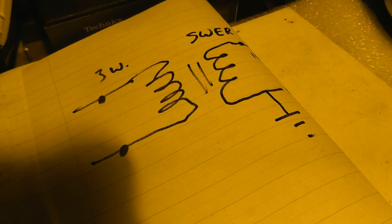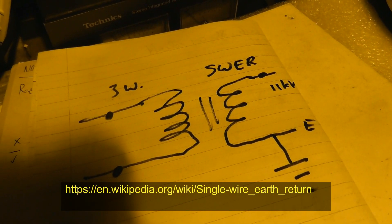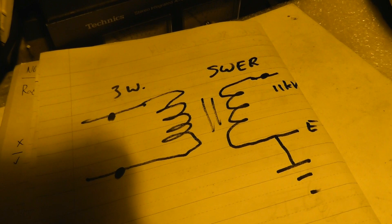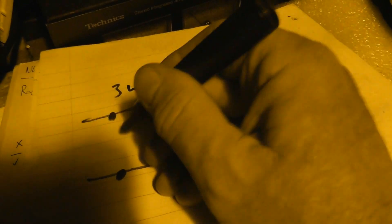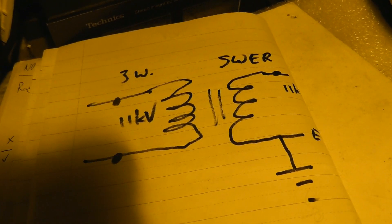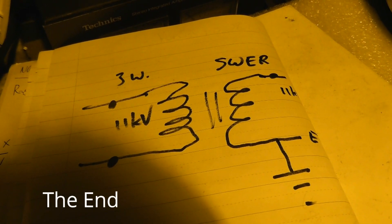In the old days they used even galvanized number eight wire. There's quite a good article on Wikipedia to read about SWER systems. This one is 11 to 11 kV in Australia, and in the South Island we use 19.05 kV — just a single tap of a 33. There are different variations of these. This particular situation is 11 to 11 kV, at 9.1 amperes on this particular transformer. Hopefully you throw in questions if you're not sure. I've got a nice yellow sodium background light here.